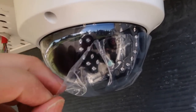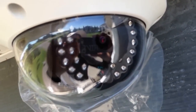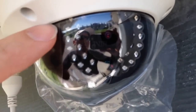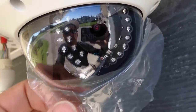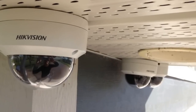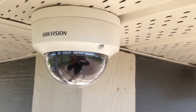The only thing left is to remove the plastic on the front. You're going to notice that some of the IR lights are actually covered up by the metal cover itself, which is a little concerning because those lights won't be useful when they turn on at night. So ideally position your camera so all those lights have access to your subject. That's it for this video — here's a final view of the three Hikvision dome cameras installed. Thanks again for watching.